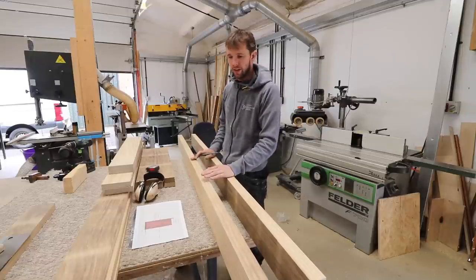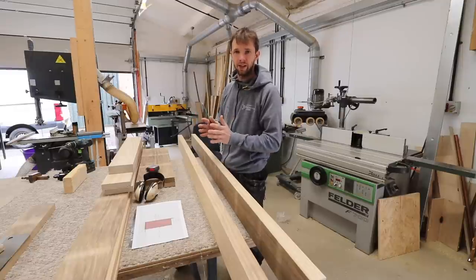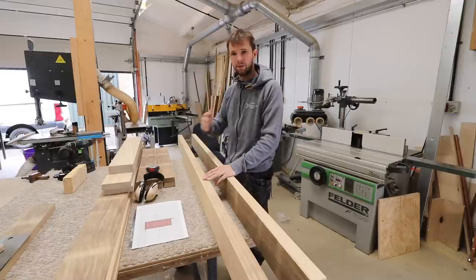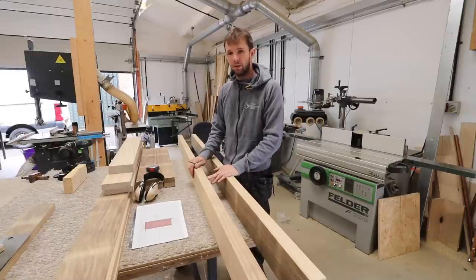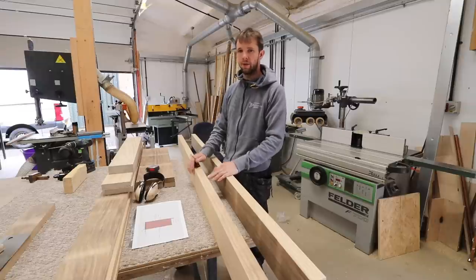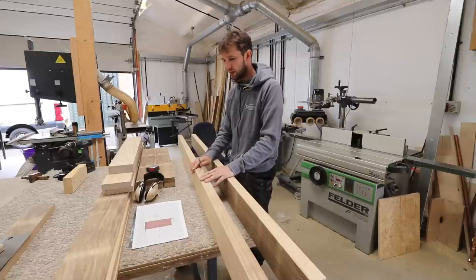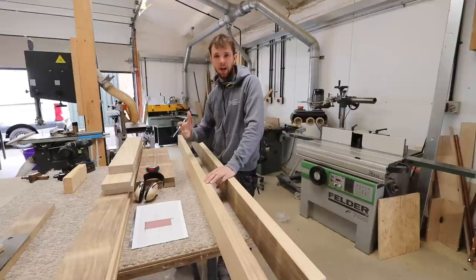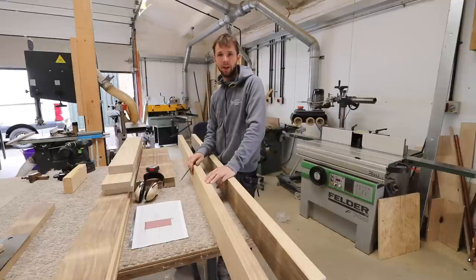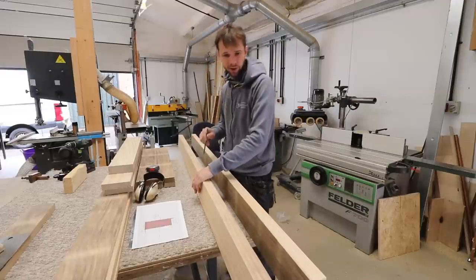The reason for that is the rails that are behind the boarding, so they're less in thickness. If you use the face as the front of the door, you'd have to pack them rails on the tenoner as you push them through to keep them at the desired height in the tenoner, or make an adjustment and move the machine. Whereas if you work from that back side where the braces are, everything is referenced from that face and can be machined all at the same time. So you just bear that in mind when you're setting out.